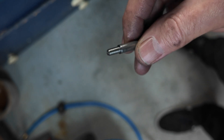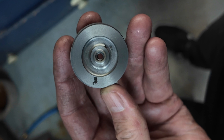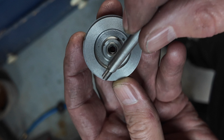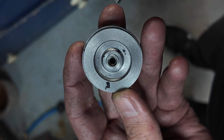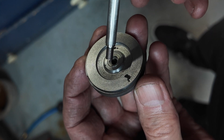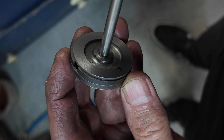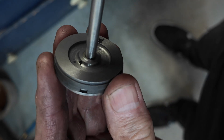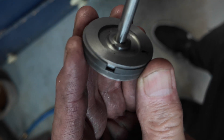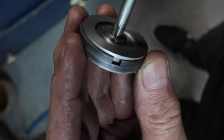There we go — that is the piston end, and that is the slider end. There is a bit of blowout there but it won't hurt anything. Just like the Myford spindle, I have got a little boss there so that is a really tight fit. I have to use some mechanical help to squash that in, but that really is a nice positive seat. And once that is in there is no wobble.